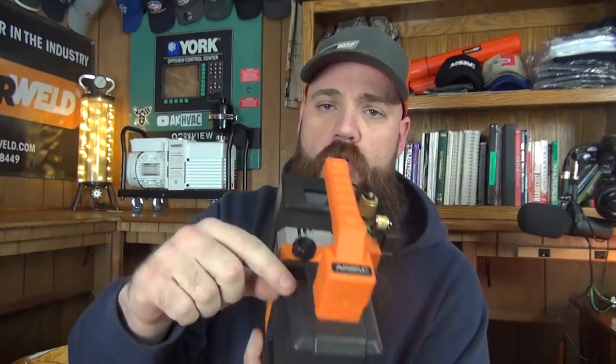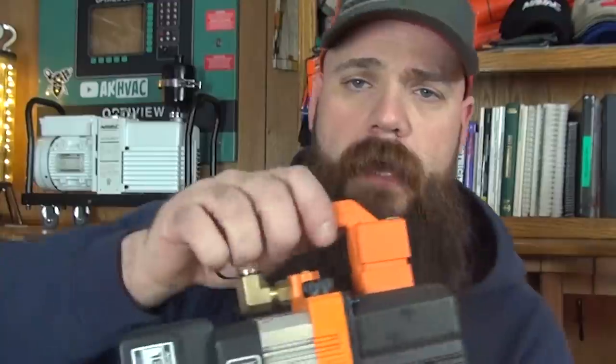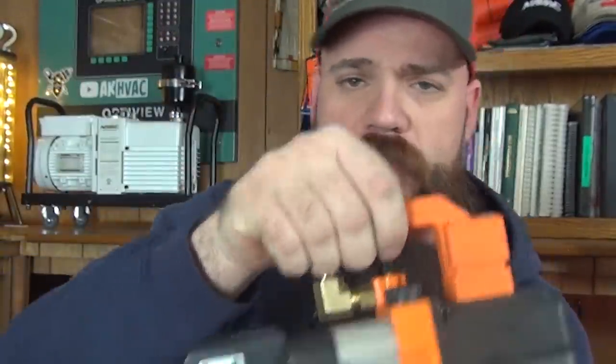You've got the battery here, an oil fill port, an oil drain port, a sight glass, an on/off button, and a ball valve to isolate the pump. There is not a gas ballast on this pump, though I confirmed it is two-stage. The other funny thing I noticed was I couldn't find an obvious exhaust port, so I have to imagine that somewhere in these louvers or right here you've got your exhaust happening. But it's super light — I think it's roughly eight pounds — and it's really one of those things you've got to hold in person to realize how ridiculously small and light this thing is.